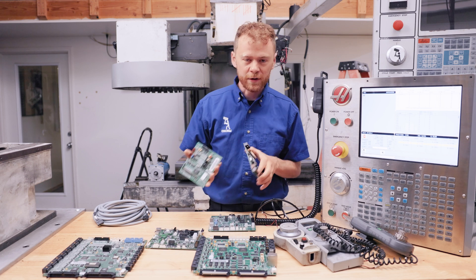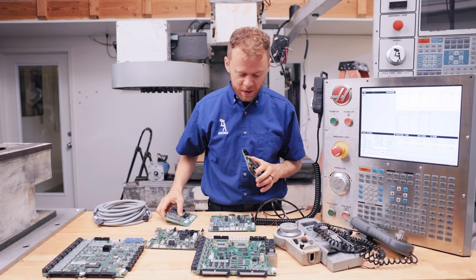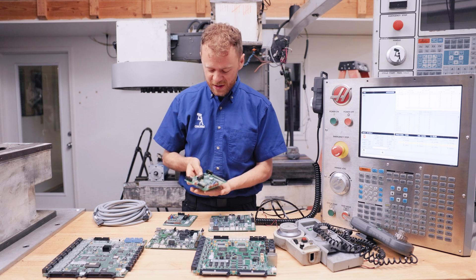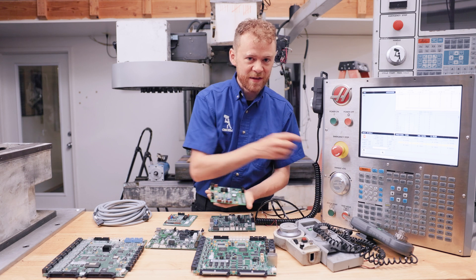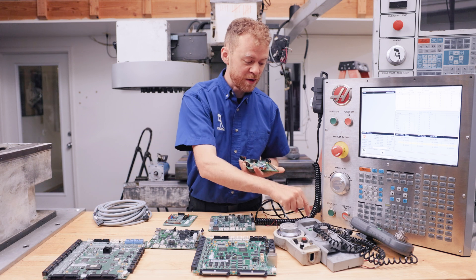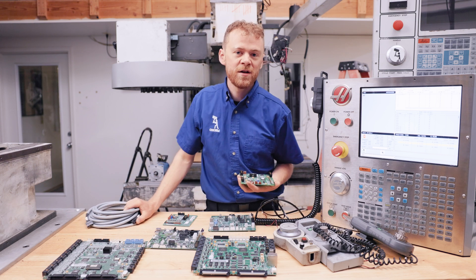You'll probably have a SkiBiff — a little serial keyboard interface board — between the pendant and the back of your machine. It's going to have a plug already to take this data to the MoCon board at P18. If you don't have that, maybe you have an LCD screen, you're still going to need a new cable.